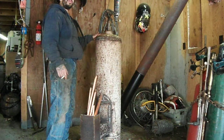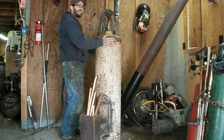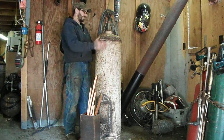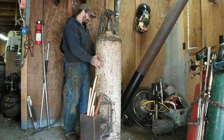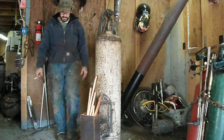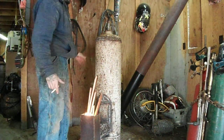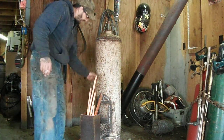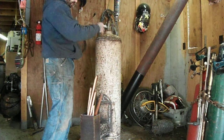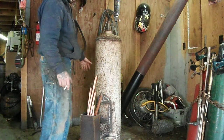This thing is starting to heat up. You can definitely feel heat coming off it — more right now than a wood stove upstairs probably. The main thing is insulating the main chamber so it stays super red hot. If it doesn't stay super red hot, it's never going to burn the secondary gases.